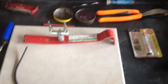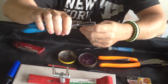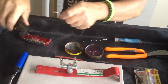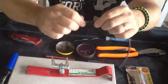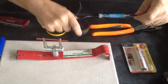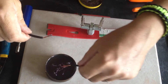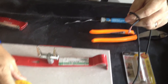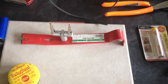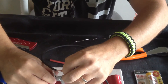All you do is take and strip your wire out. Strip it back probably about three quarters of an inch or so. You'll take both of your wires and dip them into your soldering paste, or you can just take a little brush and brush it on, or actually use your finger. Then take and twist the wires together just a little bit to help hold them, so you get a better solid wire when you solder it.